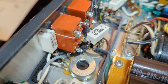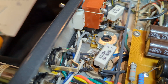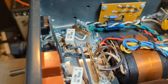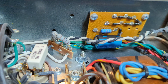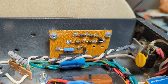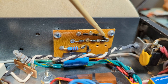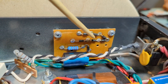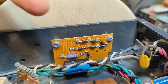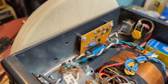The high and low power switch is interesting — I forgot what they call this specific technique for half power. It's not simply removing two tubes like you may see with other brands; they're doing something else in there. The rectifier on this side is new to me from traditional Two Rock stuff, but I've seen it in old Fenders where they take basically six rectifier diodes and string them together like the old Fenders used to do. Kind of cool.